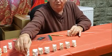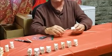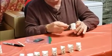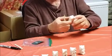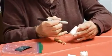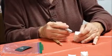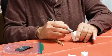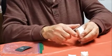The first cut we want to make is cut number one — it's just going to take the corner off here and that's going to define the owl's face. We're going to come down to the second line on our hash marks, on one of the corners — it doesn't matter which corner. You might try to pick the one that's got the best form to it. You could also draw a line from the top corner down to that hash mark on both sides of his face. Everything inside that little triangle — you want to remove that, because that is not part of the owl.